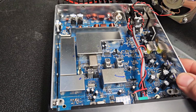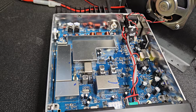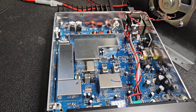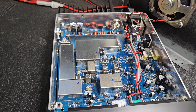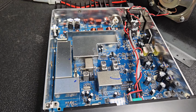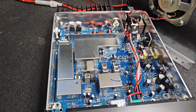Well, I can pretty much show you what to do. I don't have to unbox the amp and go through that, because I want to get this stuff back to you. You want to make sure you don't put any more than 35 watts peak into it. That's going to rely more on you, on your side, with whatever meter you have. I would hope that you have a really accurate meter for that, because that's where the good accurate meter really plays a factor.